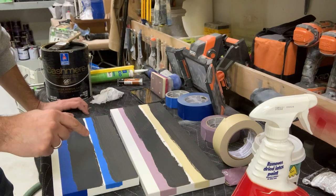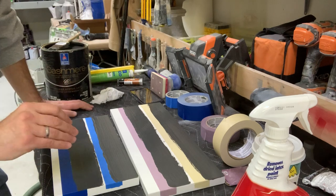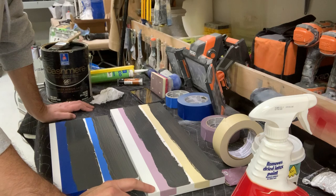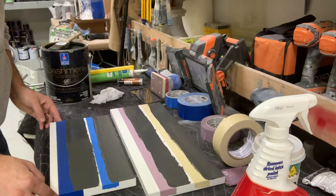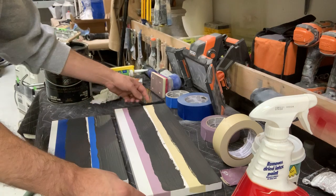It takes a little time to learn how to apply tape straight. If you've been in the game a long time and know how to work a brush, almost anybody after a couple of years of painting can cut a nice straight line without tape — you should be able to cut a ceiling line. But when you're taping on smooth white trim, I don't care how good your hand is, tape is going to outperform a brush any day. It's going to be sharp as wallpaper.